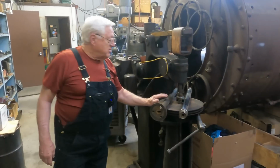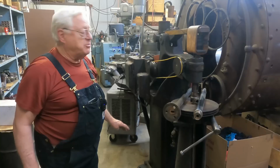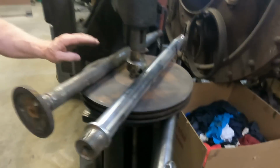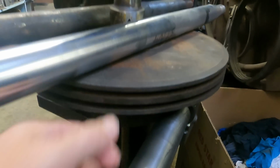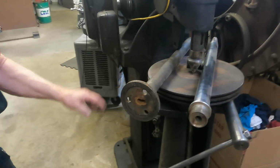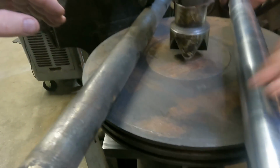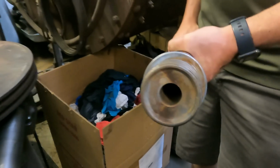All right. Well, this power hammer here was the one original machine from Westinghouse that I really need for this operation, because the piston is threaded on to the rod, which is sitting here vertically. So this is a piston out of an air compressor, right? Yes. So you got this flat disc, and that's where the rings go in there. It's very similar to a steam engine piston, not like a piston you'd have in a car. And you got the rod down here below it. Well, there's a boss on the end of the rod that would be hammered down into a relief in the piston, and then that locks the rod onto the piston so it can't come loose. Now that's the Westinghouse way of doing it.